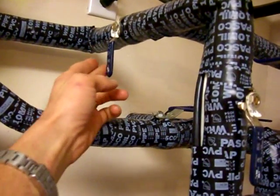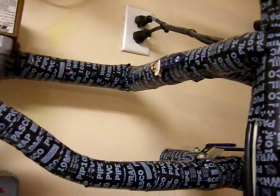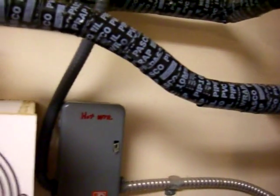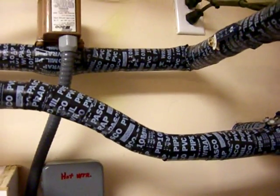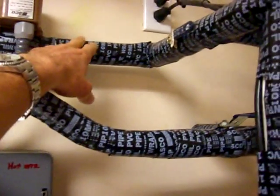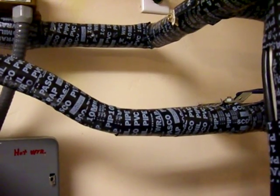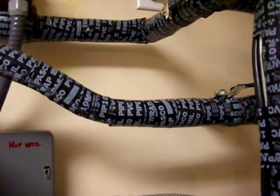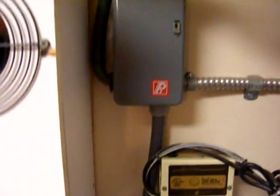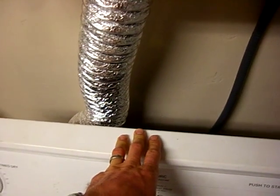Water goes back to the tank. I'll turn this valve on — that's so at nighttime it doesn't automatically thermal siphon into here and start heating my garage. I'd like to put a one-way valve on later on somewhere, maybe on the return, just throw a spring-operated or whatever one-way valve in there — that'd be great.